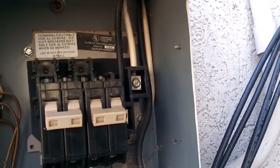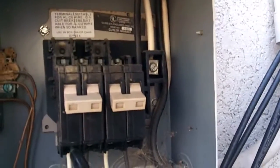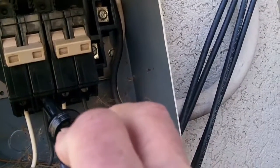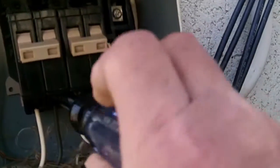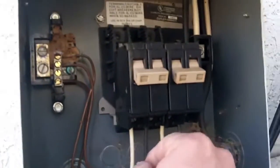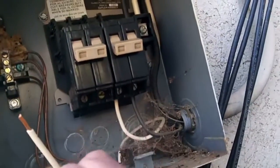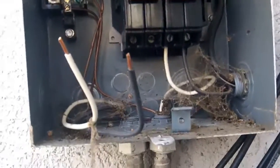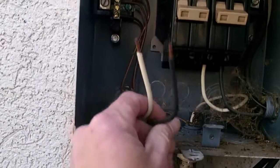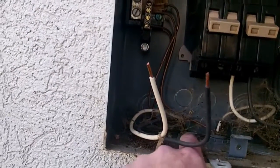To get this breaker out, the first thing we're going to do is just take your screwdriver there, since the power is off, and turn. That one was kind of loose, so it's almost a good thing we checked it. Pull the wire out like that. And actually, while we're in here, it's a good thing to check and make sure that your wires are going to the right unit. Like this one right here — it comes in from right this side here.